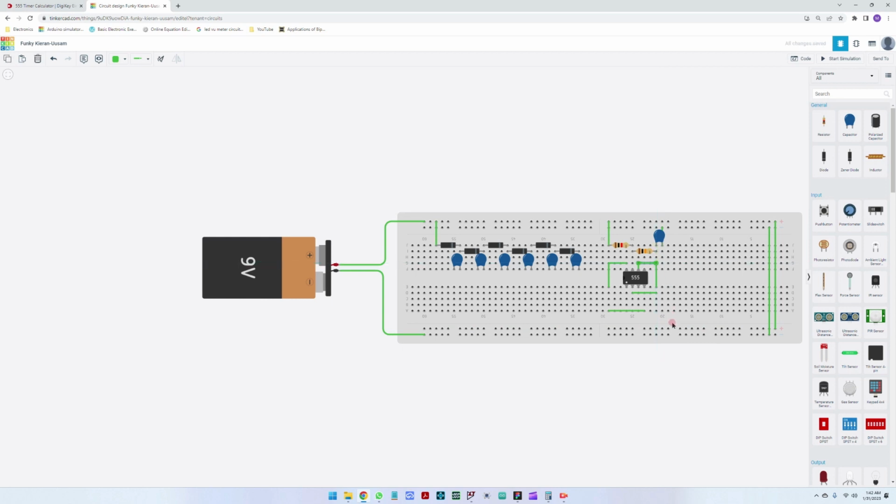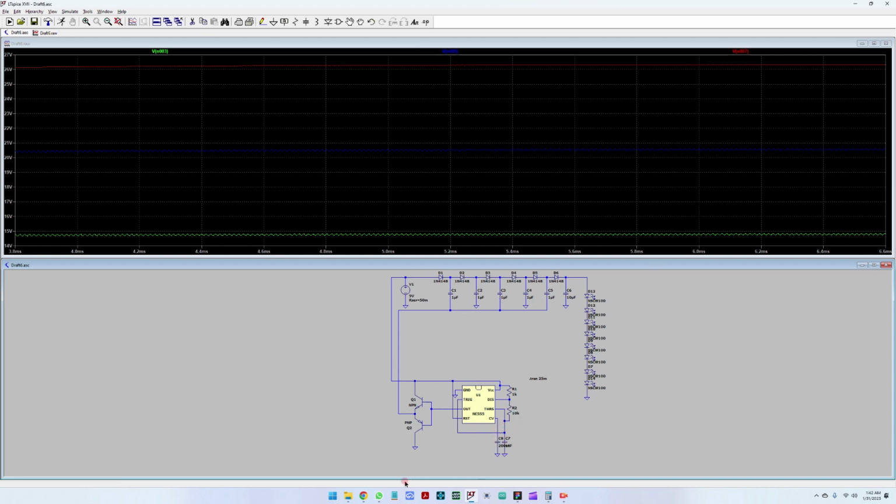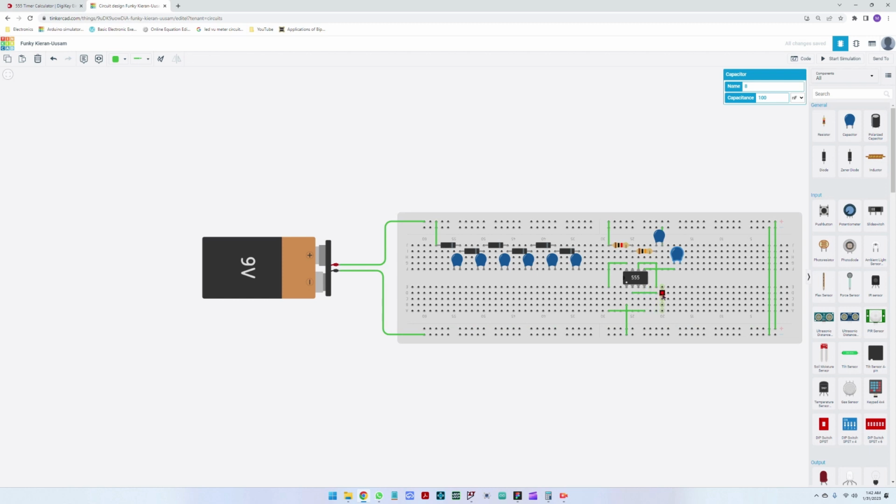Okay. Discharge power is connected. Ground needs to be also connected here. So this is ground. We need also the control voltage here to connect with a big capacitor here. So let me check how big I use this. This is a 200 nano capacitor. So going back from this point, I'm going to need a 200 nano capacitor, 200 nano, and here we have a 1 nanofarad capacitor.